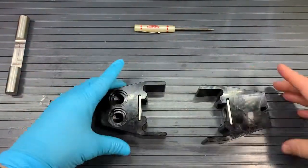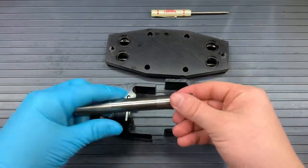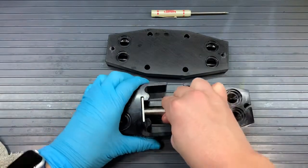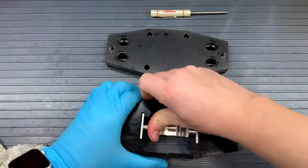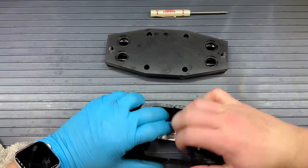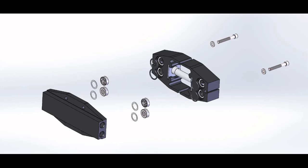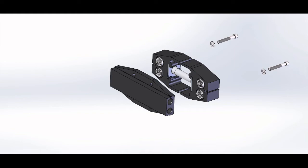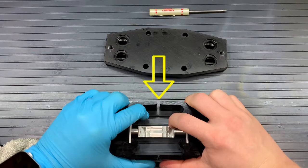We'll pack both heads, and once those are ready to go, we'll grab our plunger, and we can lightly grease each side so it slides in to each head if you want to, with that grease that came from kit A and B. And we'll want to orient that slot, so when you can see those valve pockets, the slot will be facing away from us. This will be important because that opening needs to be able to reach the cam when you put it back on the motor. So with the plunger in position in between the pump heads nearly touching, you might want them nearly touching because when you put the manifold back on top of the heads, there will be a little bit of space needed for it to snugly fit.